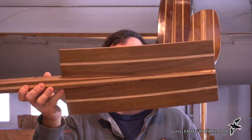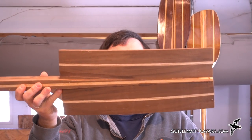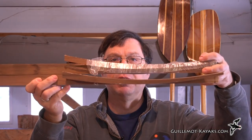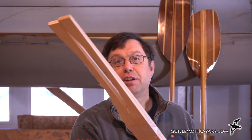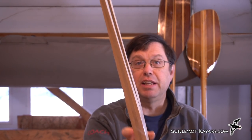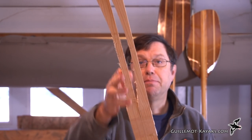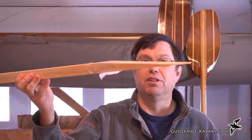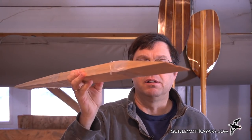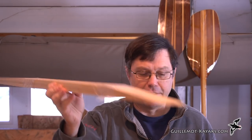I've got enough for four paddles here. I've got several of these shafts made, enough to make another four or five paddles. The blades start out like this as a rectangular blade, but it's pre-curved and glued to the shaft. So I start with the shaft something like this where I've tapered the ends to put the blade on and pre-cut the curve on the power face. This has got a couple scarfs on it ready to make an un-feathered paddle.